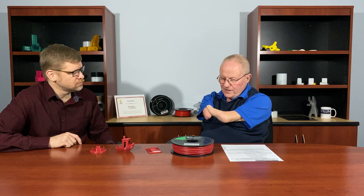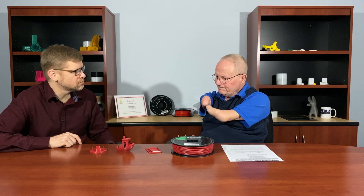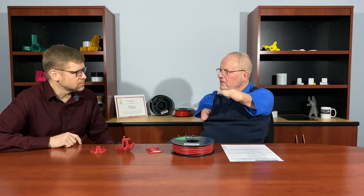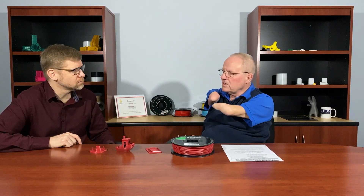So it is a little softer — you're getting some more softness to it, but at the same time you still have that rigidity. The other thing is your notched izod, where you're looking at your break point. The notched izod is about 25% higher on this than it is on tough PLA and PLA-ABS. So it's a little stronger, a little more forgiving and softer than the others. You're moving up the chain toward a softer material, but it still has a lot of performance to it.